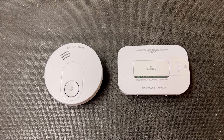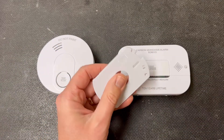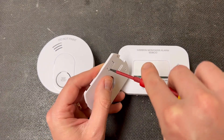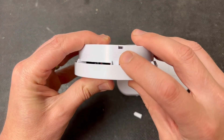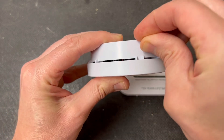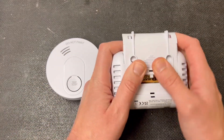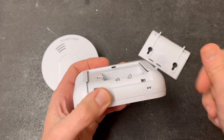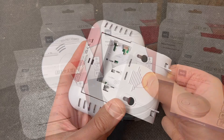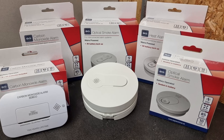The battery-only detectors are simpler in their design as they have no incoming wiring and simply consist of a backing plate that sits on the ceiling. The smoke detector has a little locking pin in the back plate that pushes out like an airfix model piece. The detector twists into place on the base, then there's a gap that lines up for the fixing pin, and once that's slid into place the head is locked to the base and can't be removed without it. The CO alarm has replaceable batteries and when the head is slid off the base, pins spring down when the batteries are removed, preventing it from being replaced without batteries. This range from BG Electrical provides excellent protection for many domestic properties and comes with 10-year guarantees for peace of mind, and crucially the range meets all of the relevant BS standards.